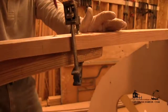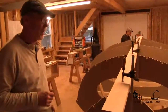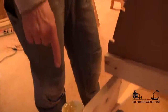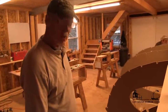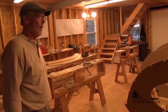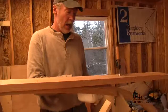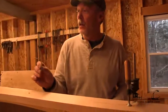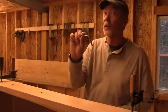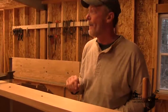Dustin is wiping down with a rag with denatured alcohol, which cleans up the residual epoxy and makes future sanding easier. This is our leftover squeeze out, and just for my peace of mind, I like to leave a sample of whatever batch of epoxy I've just used. In the morning I'll poke that with my thumbnail and I'll feel a lot better that the epoxy is cured and I can remove clamps and screws. The stuff is reliable but it's cold and you just never know. So I'm now going to put angle brackets at each mold tying the keelson down, and work my way up to the stem where I've got the one that fits the stem angle, and tie it down so all these clamps can come off tomorrow morning and we can bevel in preparation for planking.